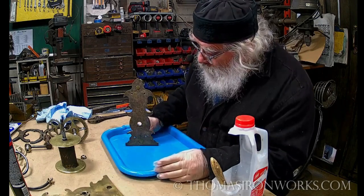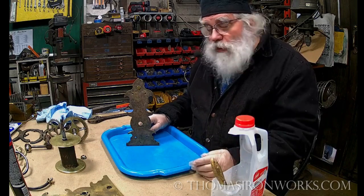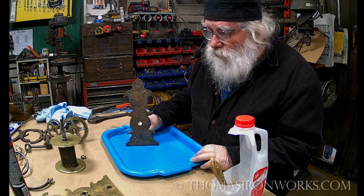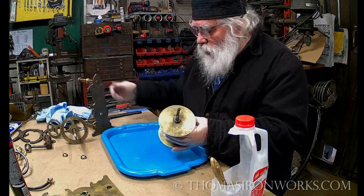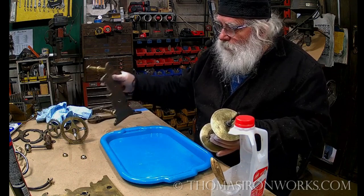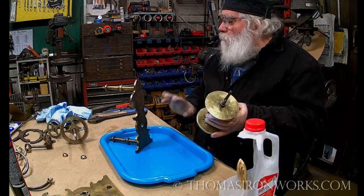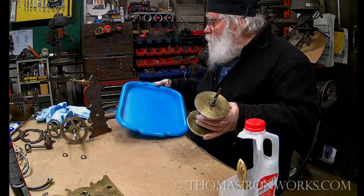It's cold weather right now, right about freezing, so the lye isn't very active. If it was an 80 or 90 degree day it would work even better - temperature makes it more active. But I had no problem - it cleaned everything right off and now we have this beautiful piece. I did my work in a little plastic tray with the lid from a storage tote. Protect yourself and your area because it's caustic - it will sting and burn.